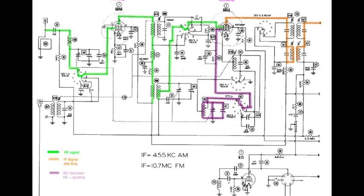There are a number of ways of orienting the relationship between a coil and capacitors. And this one is the one that allows a certain number of frequencies to come into the radio. It's not filtered them down to the one frequency you're listening to yet. That happens right here. But it is filtering out a lot of other stuff you don't want to hear. So this is a bandpass filter. It's still another use for an LC circuit that you'll run into.